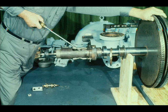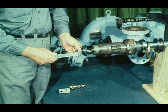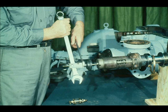Now that the main body of the constant speed governor has been reassembled, check the weights for proper operation. This is done by prying the end of each weight out from the case and allowing it to snap back to its original position. Watch the spindle and other governor parts very closely as you do this to ensure that they are working smoothly. The workman then replaces the jam nut on the spindle and measures from the face of the jam nut to the end of the spindle — this measurement must compare with the measurement taken during disassembly. The next step is to replace the spindle connection and tighten the jam nut against it, locking the connection in place.